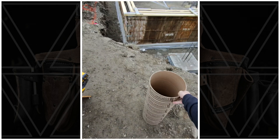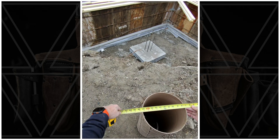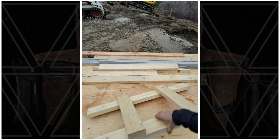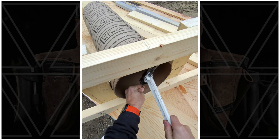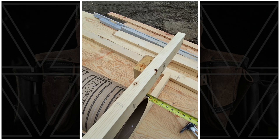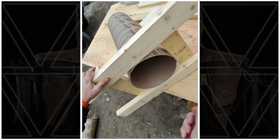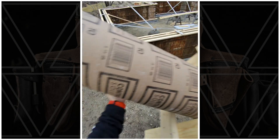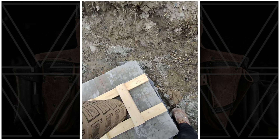Pretty darn flat. Now I'm going to build a little collar around the bottom of the sonotube — two 2x4 widths, 3.5 and 3.5 is 7. Measure across my tube: 17 and 3 eighths. Cut two pieces of that. Now I'm just going to fasten this tube to this little frame — you can see how that fits in there nice. Throw a two inch nail on either end, same thing the other way. Should be an inch and a half on both sides. I've got all my center lines on the outside of my little frame and I've already got centerline snapped on my pad down here.